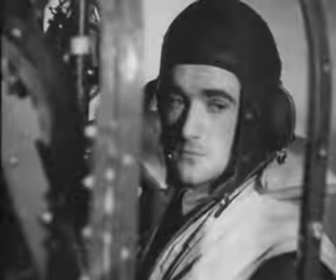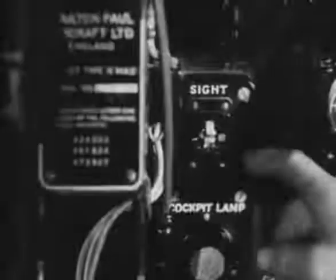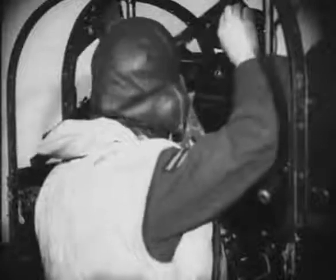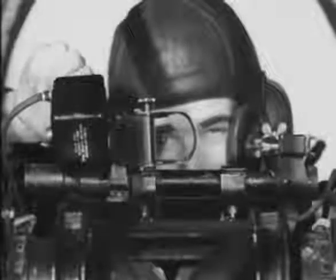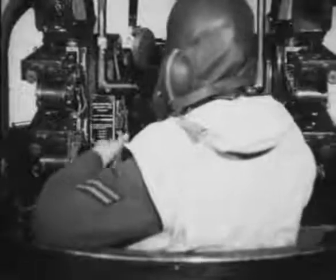But you cannot check your sight until you have switched on your master sight switch. Now he can check his sight, which, satisfactory, he turns the firing switch to gunner. The word gunner reminds him that this is the time to cock guns. Each gun is cocked once.